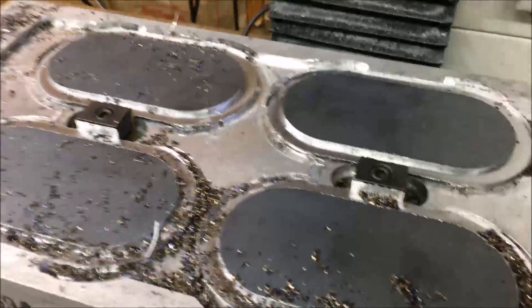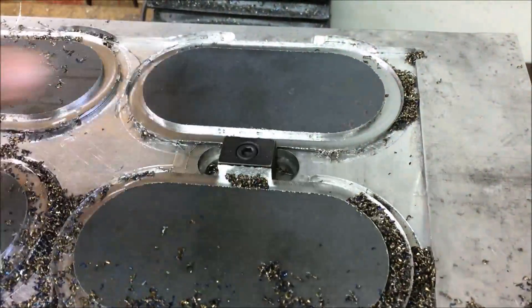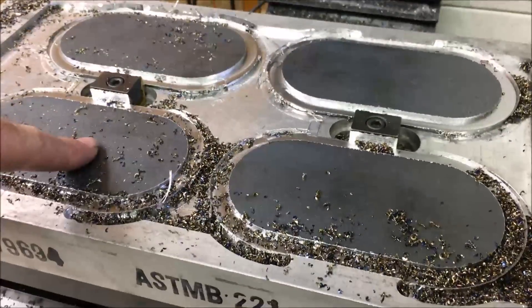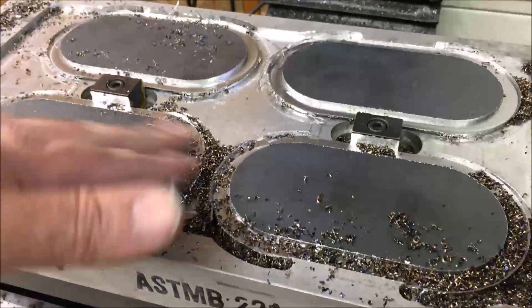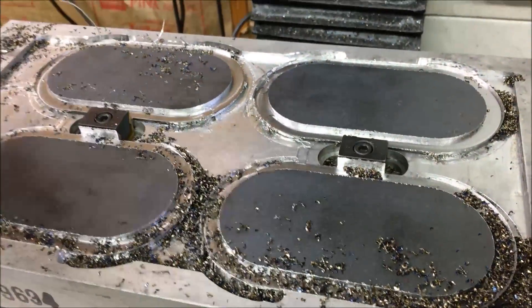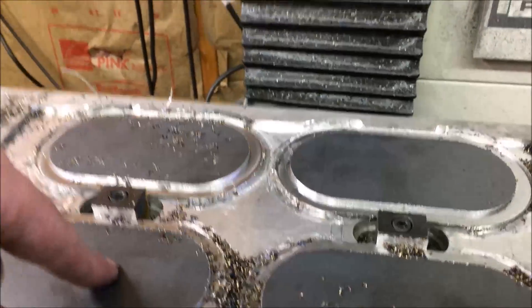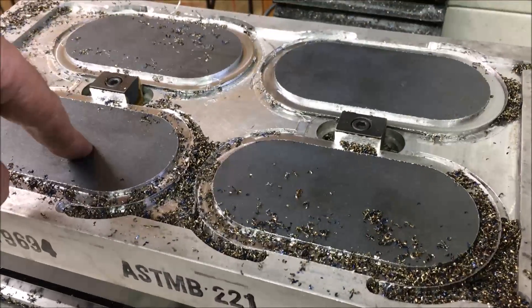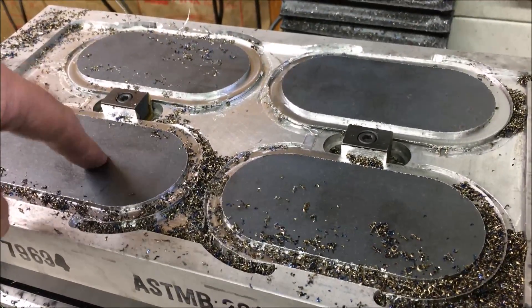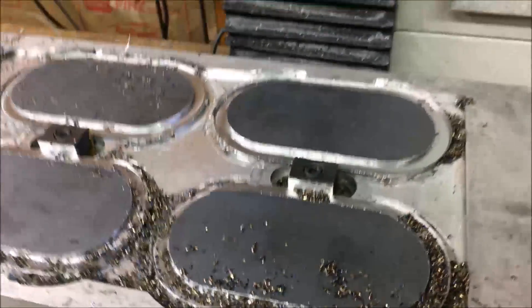So the next one is going to be the drill — putting the 5/16" holes in here. I'm going to be using a 5/16" carbide twist drill. I get more torque with carbide, so I can run it at a higher RPM closer to my spindle's max power. But I'm still getting a rumbling when it enters. You'll hear it when I run it.